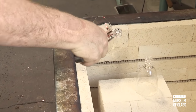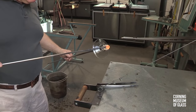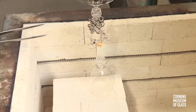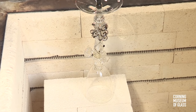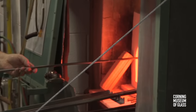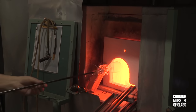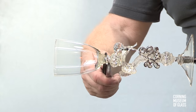Assembly starts with attaching the foot to a punty, and after the punty stiffens sufficiently, a tiny bit of molten glass is added to the tip of the knop. The dragon is picked up with pincers and stuck on. After another bit is added to the top of the dragon head, the cup is stuck on. The entire construction is flashed in the furnace to ensure that everything is the same temperature, and while the uppermost glue bit is still hot, a final straightening is carried out.